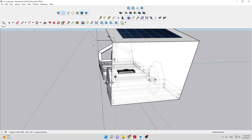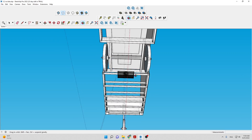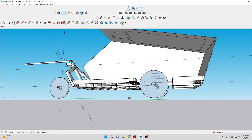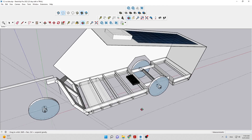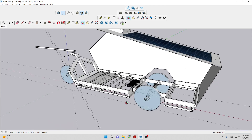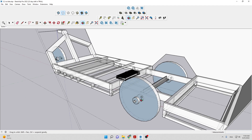Insetting the wheels does mean a narrower wheelbase, but I think it should be stable given the weight distribution and the longer wheelbase — I think that should be just fine, but I'm open to suggestions. The wheels will be Cat Trike 20-inch OEM wheels, and I'm going to machine down the Flexi Ride spindle to 20 millimeters. My local machine shop said it's possible, so I'll use the full diameter — that should be plenty strong.